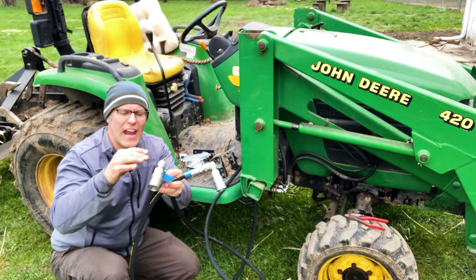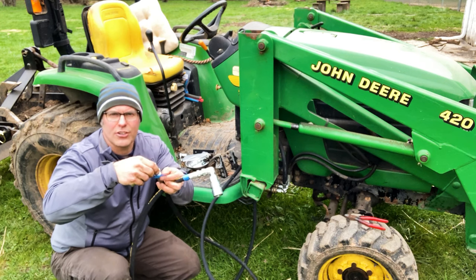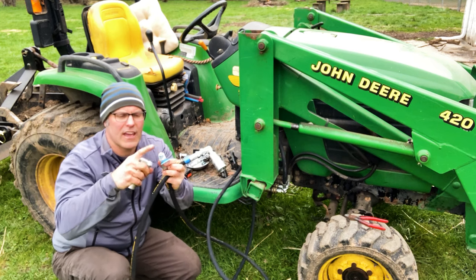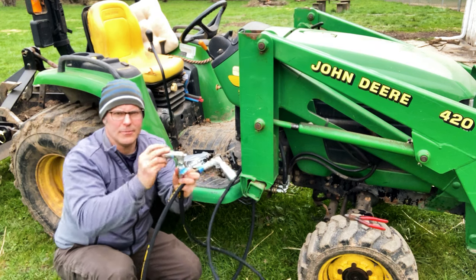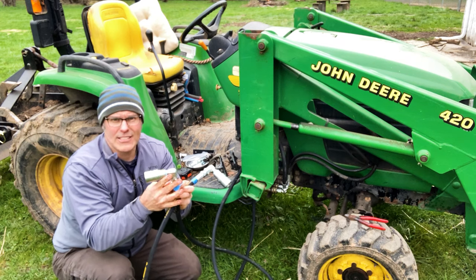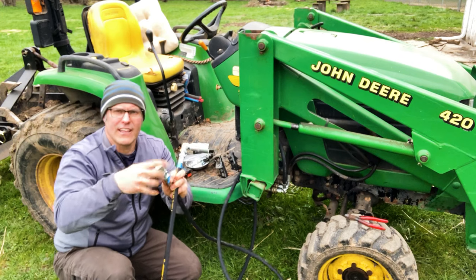On this tractor, we do terminate with 90s, and I've got them marked here with blue tape — it'll have a little sticker saying 'tighten after mounting.' If you need to get through a tight spot, you can take that coupler off and reattach it later. I do that because with the 90, you could want to change the angle, and it's easier to just not have it tightened on there. So try to find the neat routing, and if you need to take that off, let's do it.